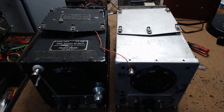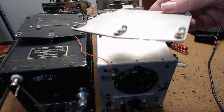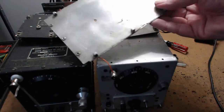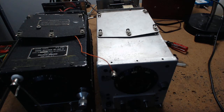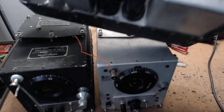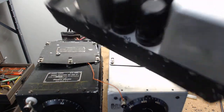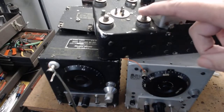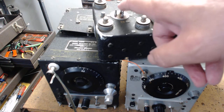Here's how the top looks on a silver one. These things could be missing when you buy the radio on eBay. This is a bottom plate - that's what a bottom plate looks like. A lot of times on eBay this is all you'll see. You can see the tuning caps in here. Sometimes this plate is missing - what you're looking at is a radio that's been salvaged. Back here are four shock mounts for a dynamo motor, and a lot of times they're missing.